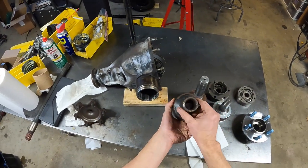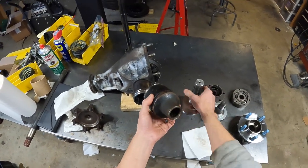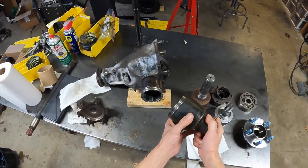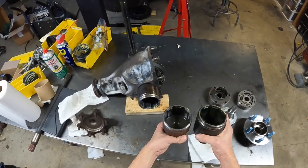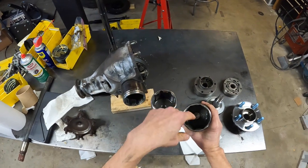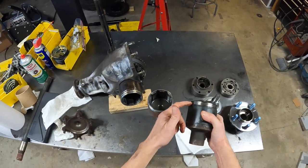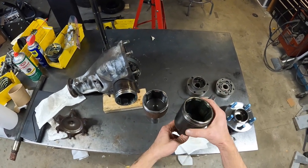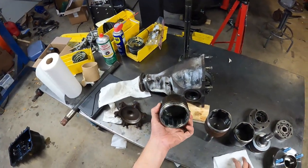But what's crazy is it's not just a similar joint, it's the same joint. These are made by NTN in Canada, I believe, but either way, North America, and so are these. Besides being a little bit longer, they are exactly the same joint. Matter of fact, all the parts are interchangeable. The race, the spline on the shaft, everything is exactly the same. This just has a little bit more travel, which ultimately was very fortuitous because I realized I need a lot of travel. And so this part here ended up just being practice.